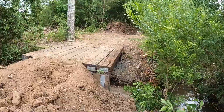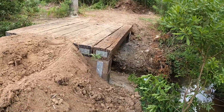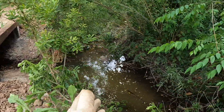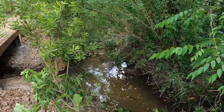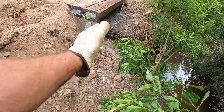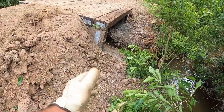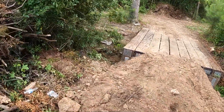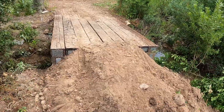There you have it — a bridge going into the woods. Now I'm going to go grab some 80-pound bags of concrete. I need to make a shoring right here. I have creek — two forms of rushing water come through here. I'm going to build a nice retaining wall right here on this side, and a small one on this side, so I don't want to put too much more dirt.